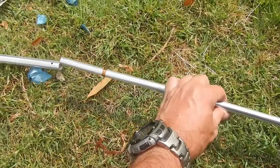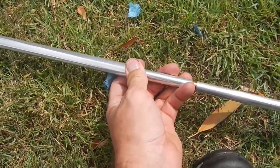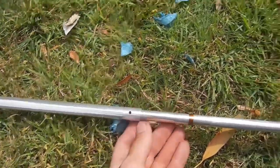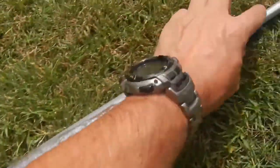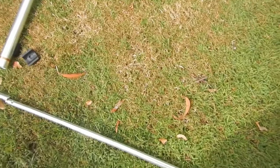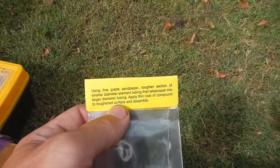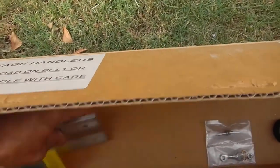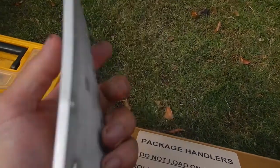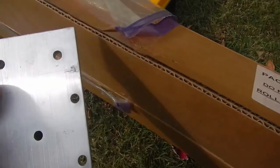I am assuming I'm going to have to get a small drill bit and drill into that, which is interesting because you don't really want to do that until you've actually tuned it and all that sort of stuff. I am going to face these with the drain holes downwards so they don't fill up with water. I have checked the elements and they all move inside the traps there, so that's good — suggests it's all connected up. One thing suggested is there's an anti-corrosion compound, and it basically says to use sandpaper to rough up the ends of the smaller elements that go inside the larger elements, then put the anti-corrosion compound on. I'll get around to that shortly. The mounting bracket — I believe this one actually fits on a 2-inch mast, so I'll have to check that out.